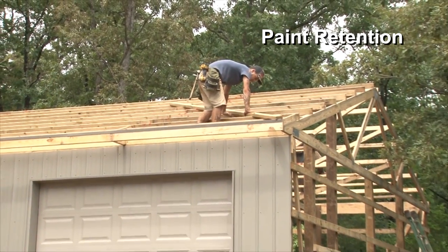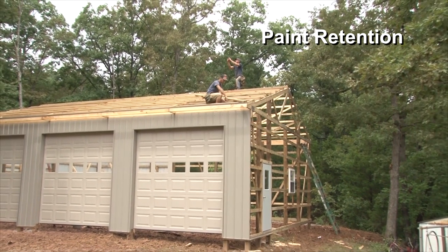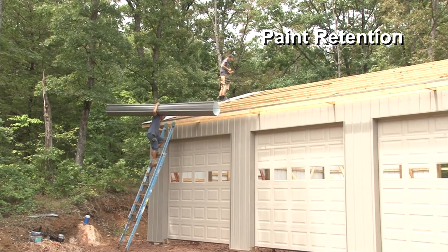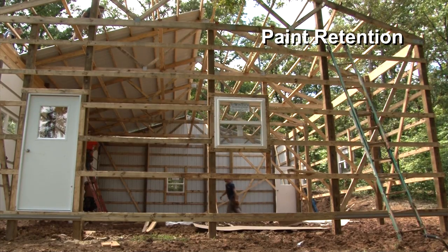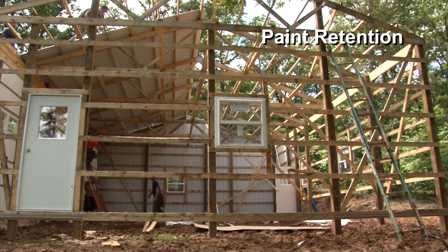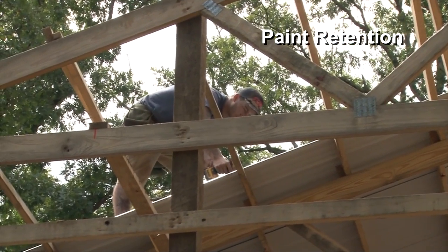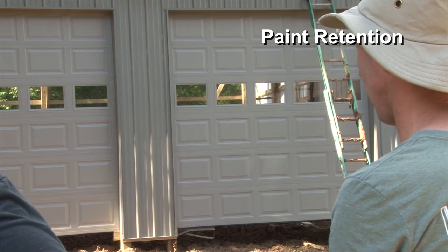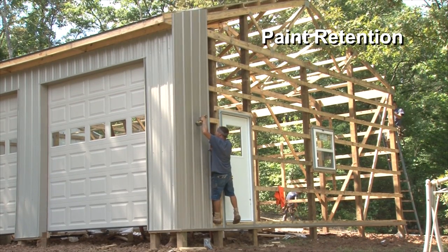The main reason we use 40-year panels is color retention. You look around and see red buildings that have gone pink, or green buildings that aren't quite so green anymore. It doesn't matter what deep dark color or how much sun exposure — there's very, very little separation in the paint pixels over 20 years. We've done hunter green roof extensions where we take a building that's say 50 feet long and continue that same roof line. Once we get the crud washed off, you usually can't tell the difference — and we're talking 10 to 15 years or better in direct sunlight. Usually the biggest variation in color is due to mold, dirt, and things like that.